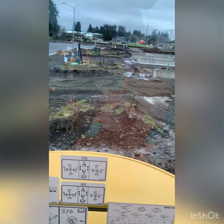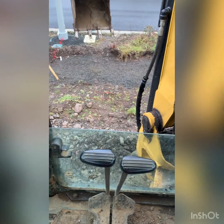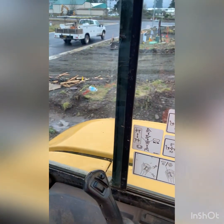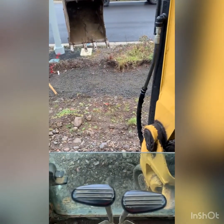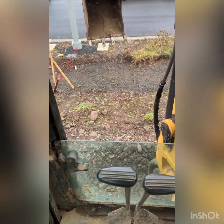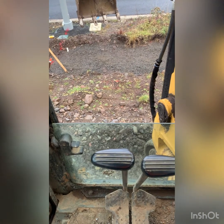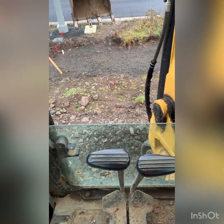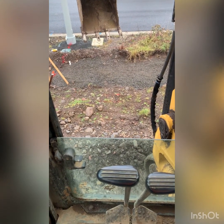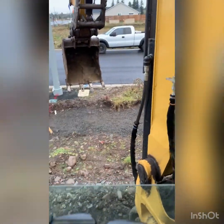That power trench over there first, but I might need to throw some of that dirt from all the trenches over here in that direction. So I don't want to do a trench there and then fill it back in with dirt. So I decided to come over here, dig the water line, the sewer, the storm, and get that all laid and get my dirt placement where I need it. Yeah, so that's the new plan.